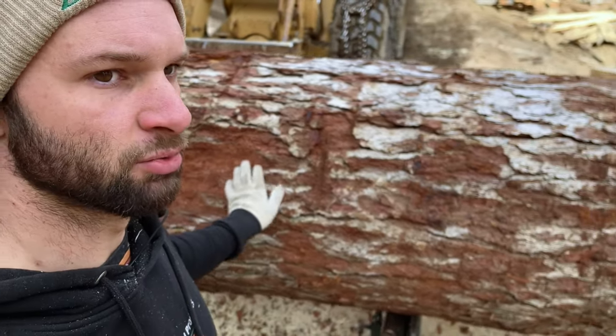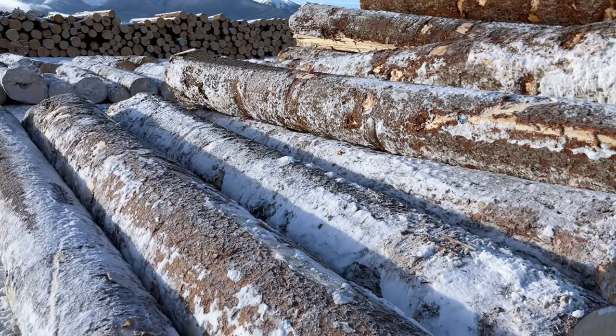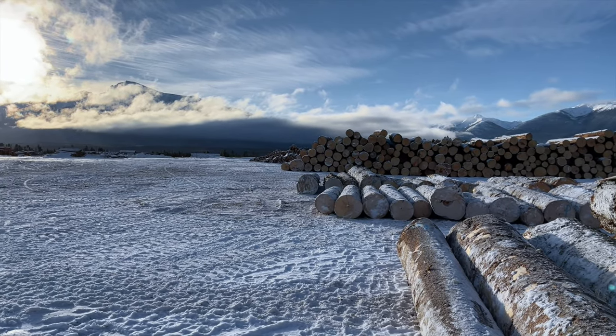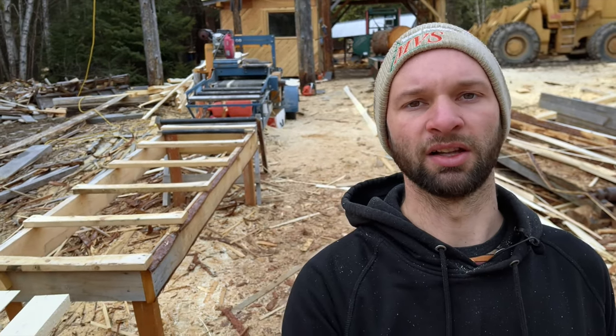It's kind of a rush schedule when we do our manufacturing, because usually in December we start looking for logs, and then we end up buying logs in January, February, and moving them over here into February. One of our deadlines with this stuff is that it has to be winter cut. That produces a better quality wood for the soundboards that are being made. And the other thing is that it has to be finished cutting, so it has to be debarked and in lumber form by the time that beetles start to actively fly in the spring.